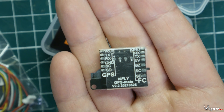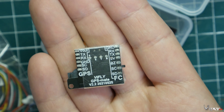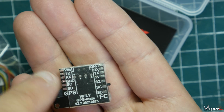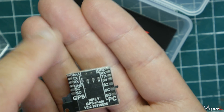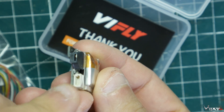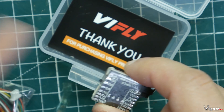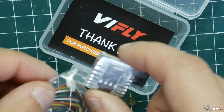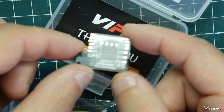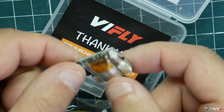As you can see, it has video out, TX, RX, ground, SCL, SDA that goes to the GPS, and on the right we have ground, receive, TX, five volts — all the connections for the flight controller to the GPS. If you are using a compass with a GPS, you do have to use these soldering pads. If you don't have a compass, you can just use the harnesses it comes with — one goes right into the GPS and you don't have to worry about soldering that.